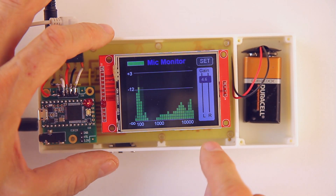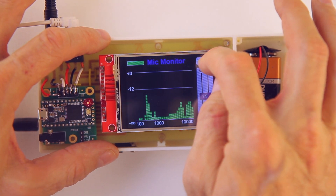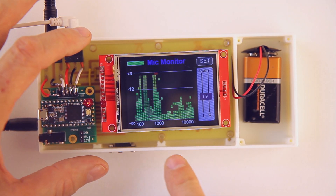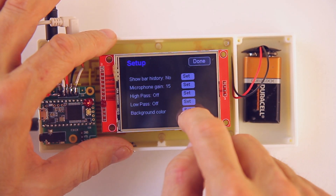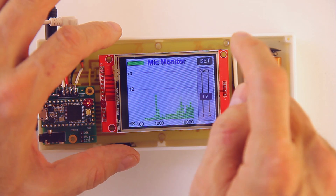The unit has a line in for your microphone, a line out that goes to your camera, and a jack for your headphones. There's a built-in high-pass filter and a low-pass filter, and you can configure what the cutoffs are. If you're recording outside, you can set the background to white with a click of a button. All these options are saved with the unit, so when you turn it back on, these settings will be remembered.